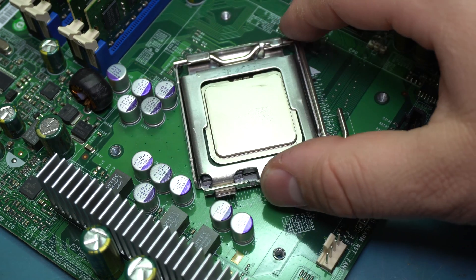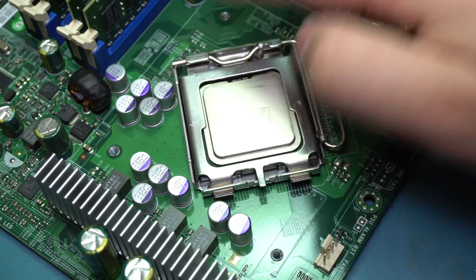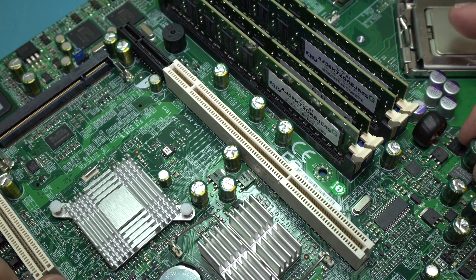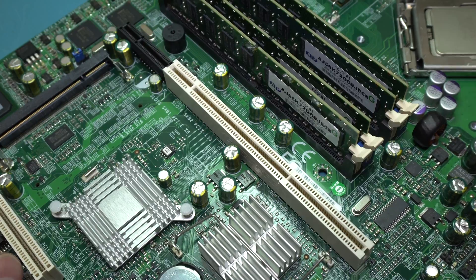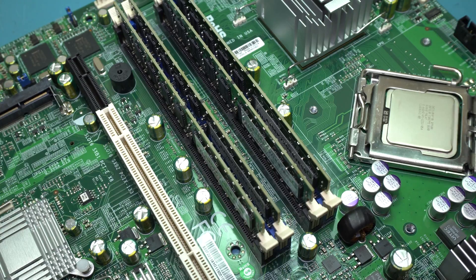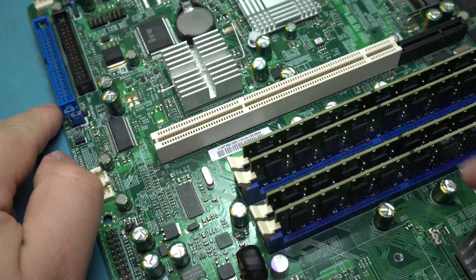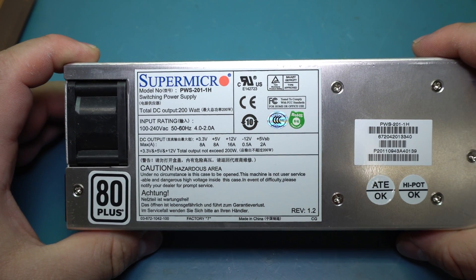They put the caps too close to the CPU, so they shredded off part of the heatsink — can you believe that? So you can't use a regular heatsink; if you get a regular fan it won't fit. It does fit but only in one orientation and only with their specific heatsink because of this cutout. So I'm always going to have to sell this board and warn whoever buys it that they're pretty much stuck with this passive heatsink. The rest of the caps on the board are Suncon — so not great.